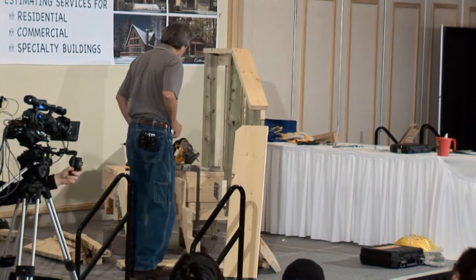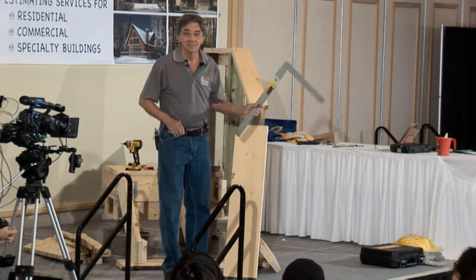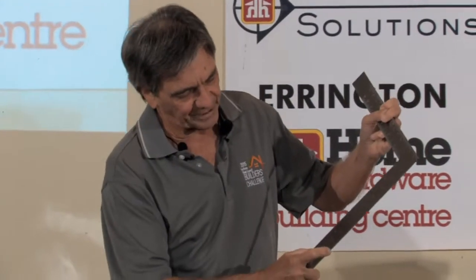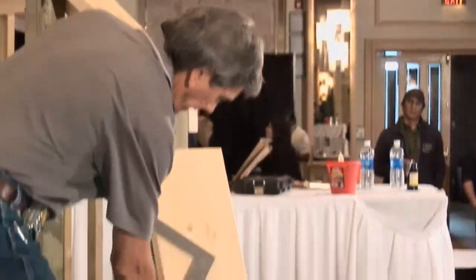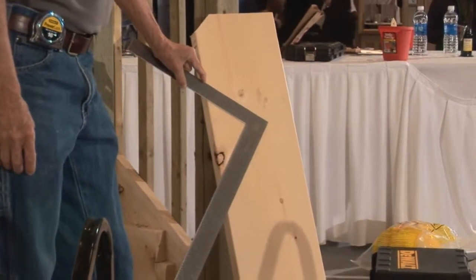So what we're gonna do, we're gonna use a tool called the carpenter square. Okay, you got two of them. You get a choice between steel or aluminum, so you can play around with that. So technically, you just find your 10 inches and your 7.5 inches here, and you can start to see that would lay out like that as you're going to lay the thing out.